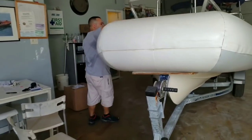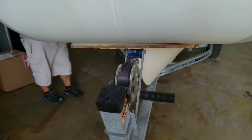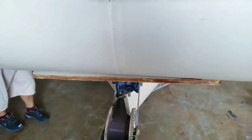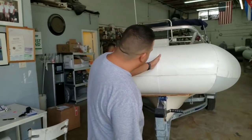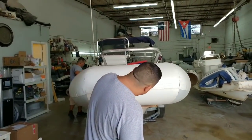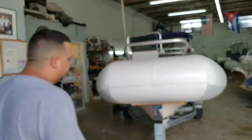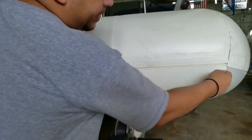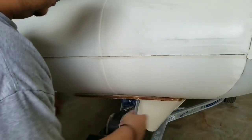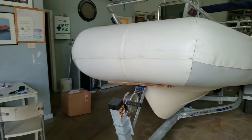All right, listen. Carlos, toe. Right? This is where they're gonna have to line it up. Come on, bro, look. The toe is basically the center of the tube. In this case, you have the baffle, which is a guide where the center of the tube is. So it's easier, but sometimes you don't even have the baffle in here. So you have to measure from the center to both sides and make sure that the tube is centered.